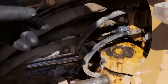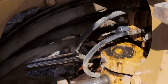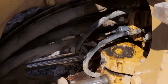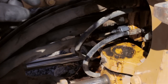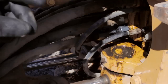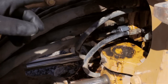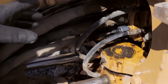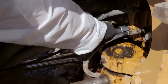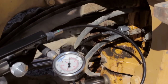This may look to some people like a JIC 37-degree fitting that has been drilled and tapped. HydroCheck builds a special JIC connector with a thicker top that makes it safe for pressure testing, because a conventional JIC fitting's top is too thin to drill and tap for test pressure testing. This is a special JIC connector specially made for safe testing. I'm now going to connect the micro leak tester up to the special adapter.